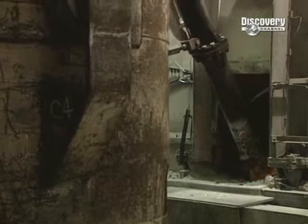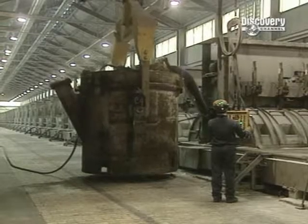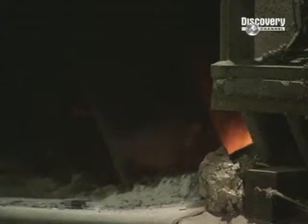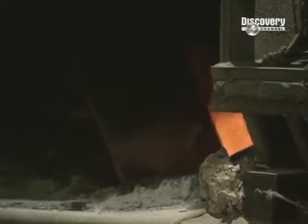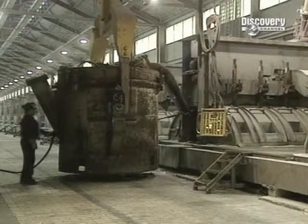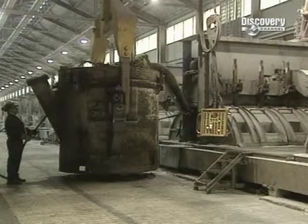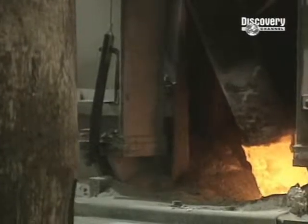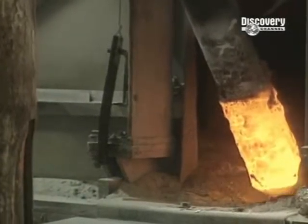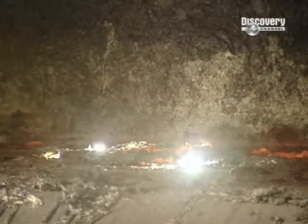It has to be recovered in this huge crucible with a tube. A vacuum system draws the molten aluminium from the crucible. Air is vacuumed from the crucible by a flexible pipe held by an operator. The tube is finally withdrawn and the overhead crane dumps another quantity of alumina into the pot. On and on in a continual flow, the aluminium continues to be created.